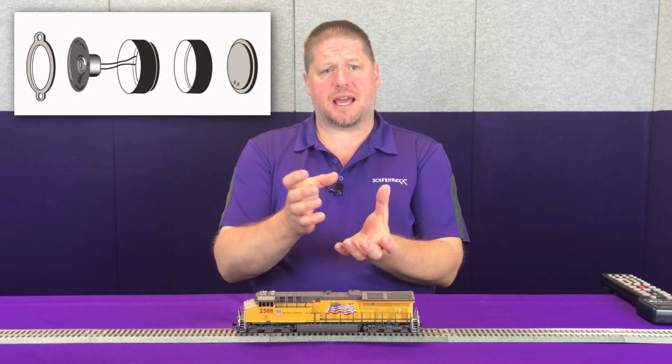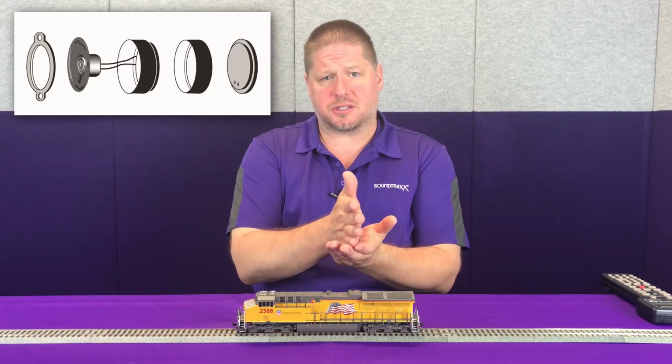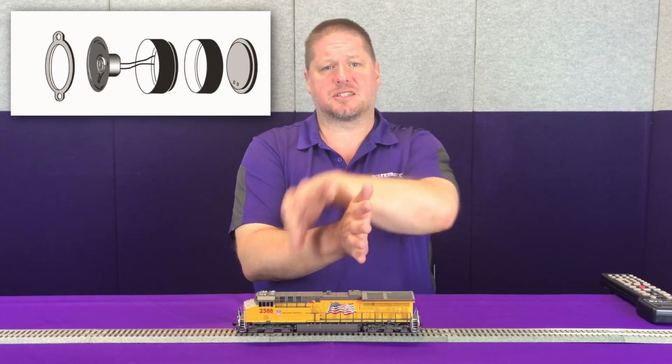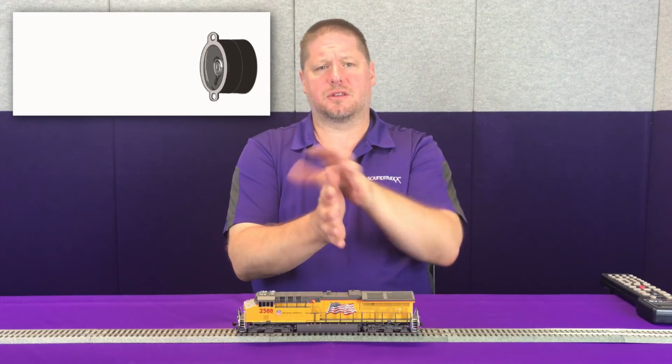Now, you also want to make sure you put a baffle on all of your speakers, because that air pressure, once it's created on the front of the speaker, if it's open to the same air, is going to cancel itself out as it works its way around the speaker. But when you put a proper baffle on the one end, as the speaker makes the sound, that air pressure in there has nowhere to go but to our ears.